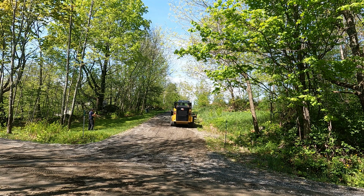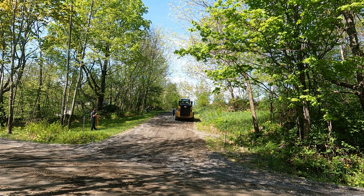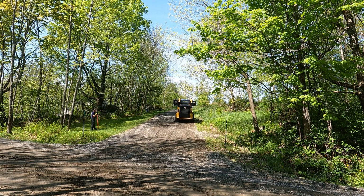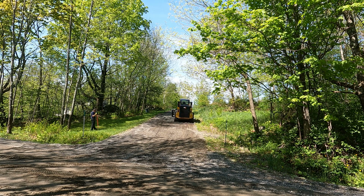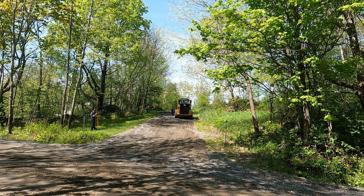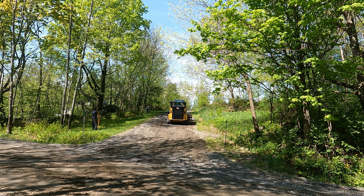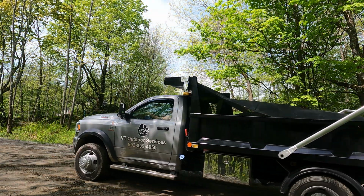And the other annoying thing is this continuous flow. Turning that on is a button above your head. You have to do that right after you start the vehicle if you are planning on using it that way. And then you have to hold the direction in which you want the drum to spin for a certain period of time. And once you've achieved that, you let go, and the drum will stay on continuous flow. Whereas the Bobcat, you click the switch on how you want the drum to go, squeeze the trigger, it locks it in, and off you go. And this thing, sometimes you hold it for a couple seconds as you're going, and all of a sudden the drum stops and you start bulldozing, and then you gotta back up and start over again. Just little things like this that annoy the shit out of me.